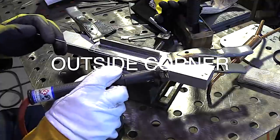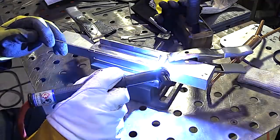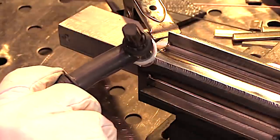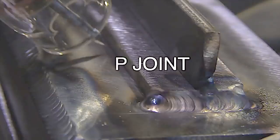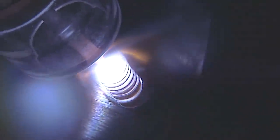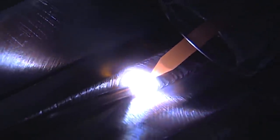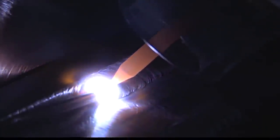Let's look at some 11 gauge steel on an outside corner joint - we're going to show lots of different joints in this video. An outside corner joint is one of the most common joints and also one of the most fun to weld. I'm just trying to flow that puddle out to just barely wrap the corners. The next shot is a lap joint, and this one will really illustrate how well the cup lights things up. I can see like a full inch of where I need to go - I can even see scratches on the metal from a grinder.